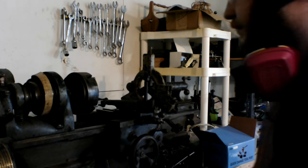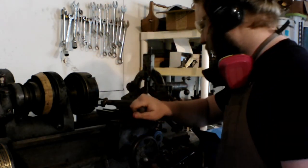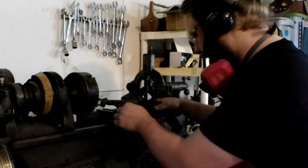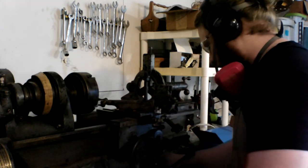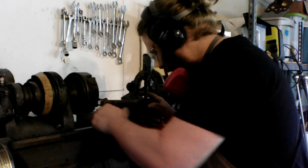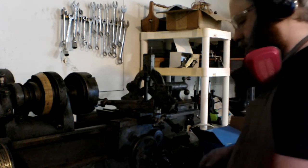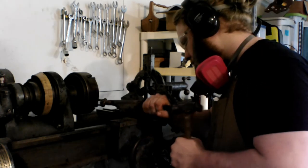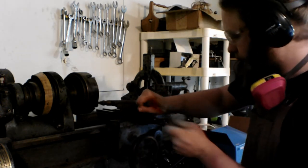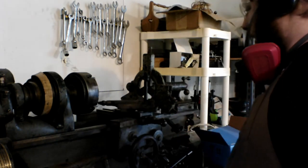Sorry about that. Okay, I got a cold chisel here. Don't want to hit the cast iron. Okay, let me tighten these, the compound cross slide up. Just don't want it moving around while I'm hitting it. Need a smaller wrench. Do not have one immediately handy. There we go. That's in there. There we go. Very happy with that.